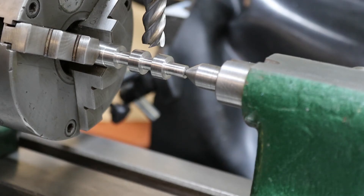I've got the blank set up in the dividing head. First of all, I'm going to get a touch on and mill it down to the base diameter of 8. And then once we've done that, we're going to be taking small cuts at 1 degree intervals.